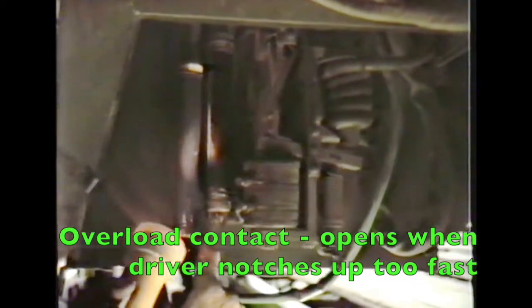The second notch, then they both stay in. This is your overload trip arm — when you cut too many notches, feed it up too quickly, that lifts up and snaps. As long as that contact up there is kept clean — because that'll get a high resistance spot. If it's not kept clean, then you've got to check your leads and make sure that they're firm, because they will break. It's a matter of wear and tear.